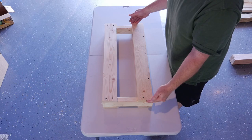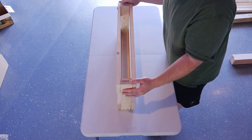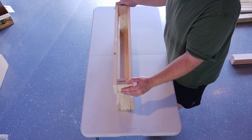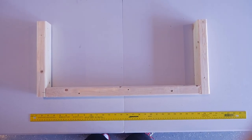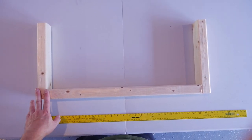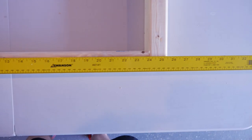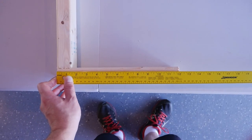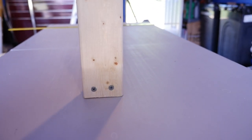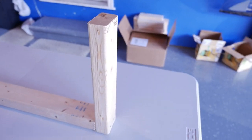The first thing you need to do is make these 10-shot mortar rack modules. There are already great videos out there — one done by Joel Robinson — that show you how to make these, so I'll quickly go over it. Here is the main frame of the 10-shot mortar rack using 2x3 wood, without the 1x4 sides on it. The base is 24 inches long and the sides of the 2x3 lumber are 12 inches long. Once you have those pieces cut, I just pre-drill 2 holes and sink 2 3-inch screws in to build the frame like this.